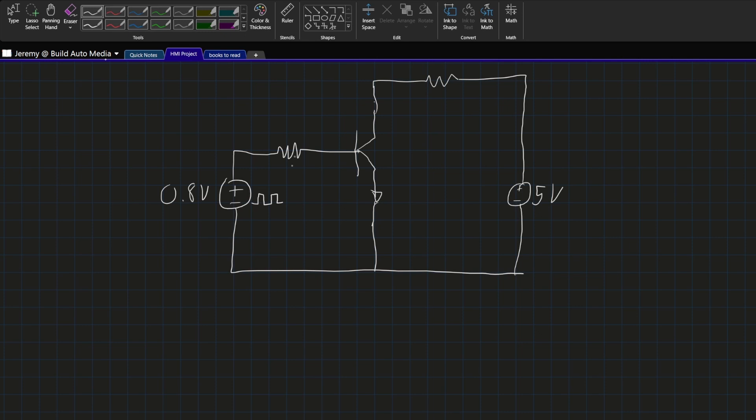You might be wondering why there are resistors in this circuit. When you think about what I just explained about transistors, it makes a lot of sense. It's not enough to just have positive here and negative here — if there aren't actually electrons flowing through the base junction, then the positive side doesn't get its holes and the n-type doesn't get its electrons. You actually have to have current flowing through the base before it becomes a straight conductor. If I force current to flow through a resistor, then in order for it to get back to negative it has to flow through the transistor. It takes about 10 milliamps in order to turn this transistor on.